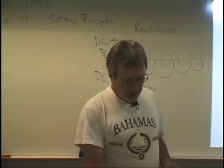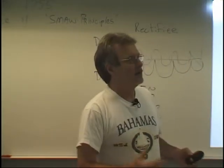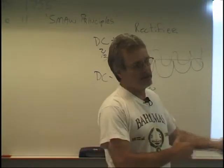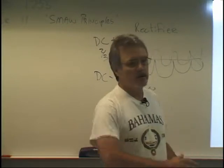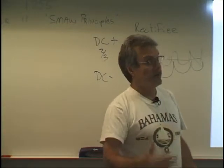So don't get fooled by where it says polarity switch, because I've gotten answers that you use a polarity switch to switch AC to DC. Well, yeah, but what's it doing? It's feeding it through a rectifier. It's actually a rectifier that does it.